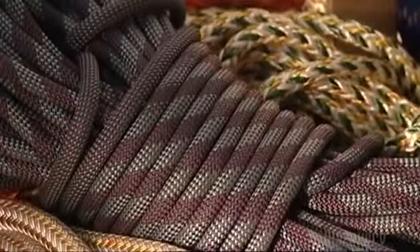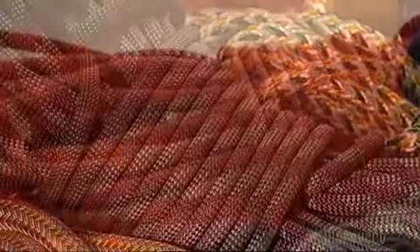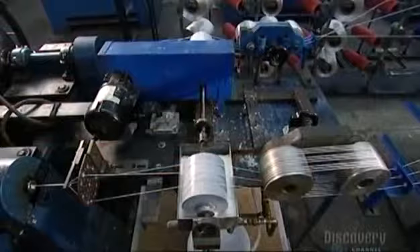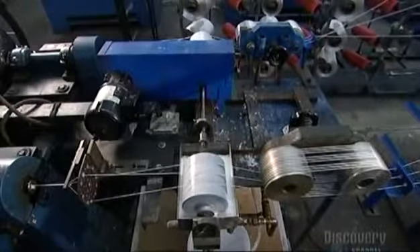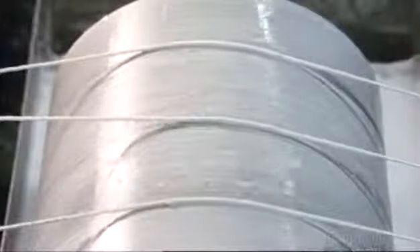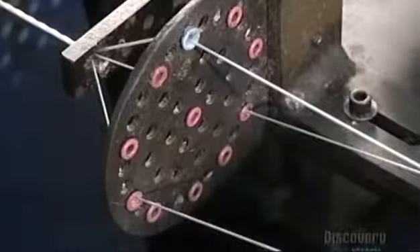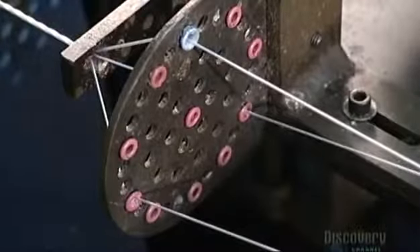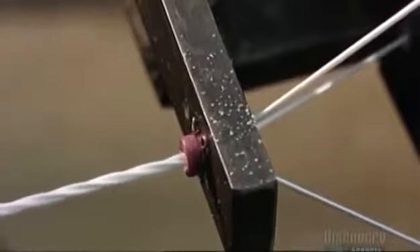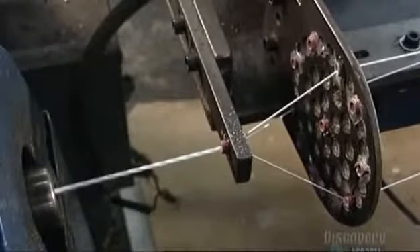These ropes are made from thousands of nylon fibers that are finer than human hair, but stronger. To make rope, yarns wind around aluminum cylinders, pulled by a turning spool down the line. Then, three at a time, the yarns roll over another spool that applies a protective coating of urethane. They then funnel through a distribution plate that holds them evenly apart, ensuring even tension, as a rocking spool twists them into one larger yarn.